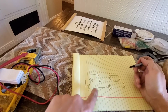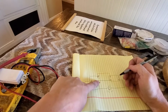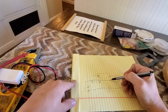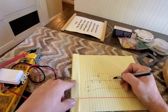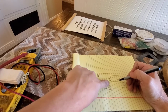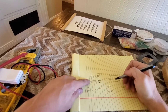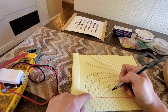You want the circuit to be continuously closed. Let's say I have this switch in the closed position on the primary side — electricity is coming through here, going through the switch, going to the other side of the second switch. Electricity will flow through and turn the light on. Now if I open the other switch, electricity can't flow until I switch the other one, which then makes electricity flow through the red traveler wire, going over to the switch, back in a big circle, turning the light on.